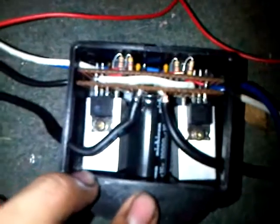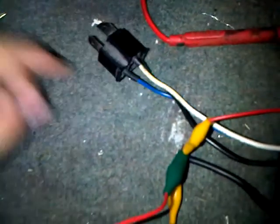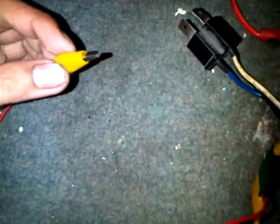As you can see, there's almost nothing to it — just a couple of P-channel MOSFETs, a couple of 555 timers inside as a gate driver, and this is the trigger input. We use this positive supply to trigger the MOSFET inside.